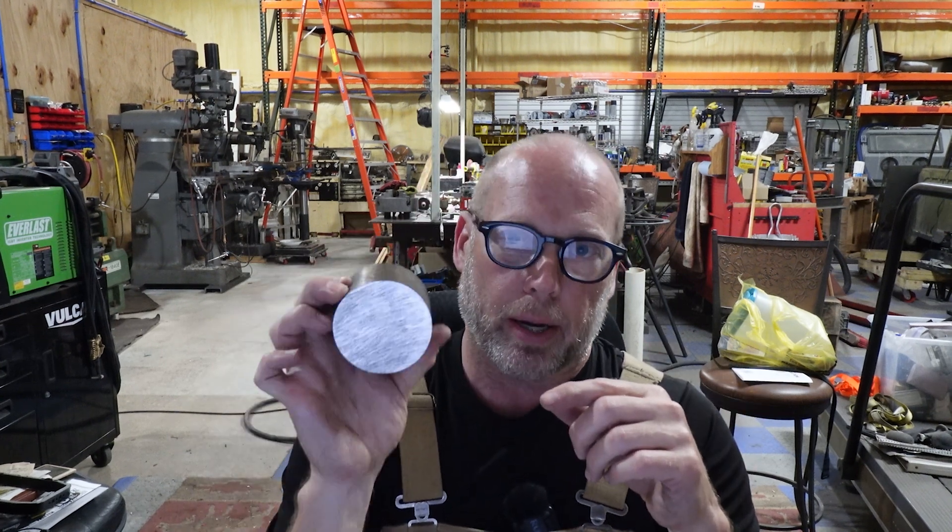The smaller the surface area, the smaller the increase in pressure inside this object. If you were to make a much larger internal volume — say, using a piece of box tubing with welded ends and some fittings — the pressure inside that tube is going to get so high that you'd probably cause distortions or damage. That's one of the reasons this chunk of steel is so big: I wanted as much material outside where I'm working as possible. We're going to go right in the center with those three fittings, drill into the center, and have a lot of steel around to give it backing force, keeping the holes as small as we can.